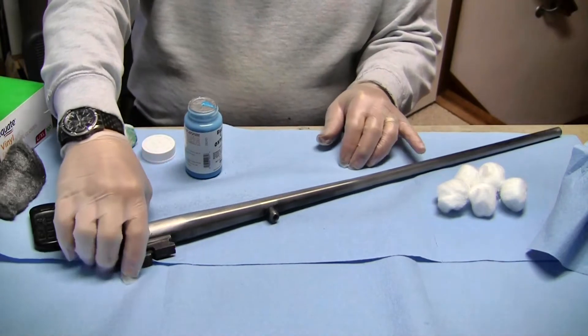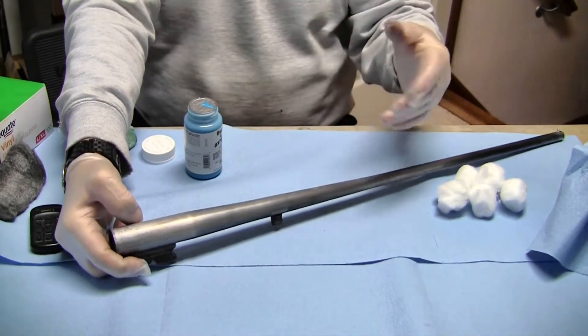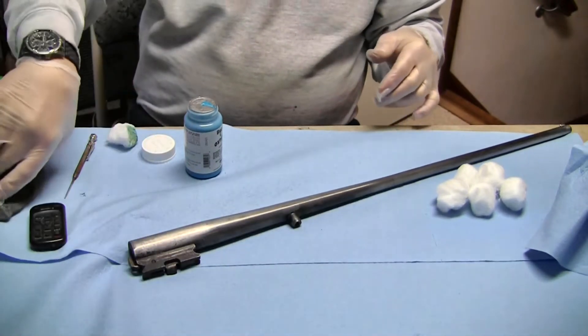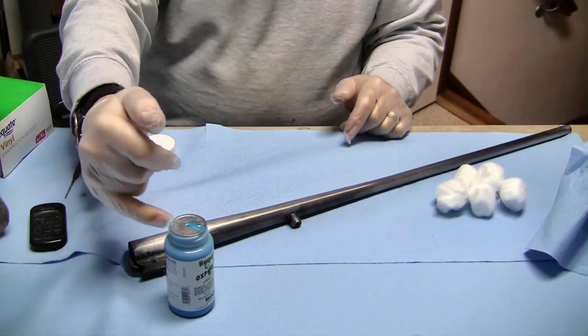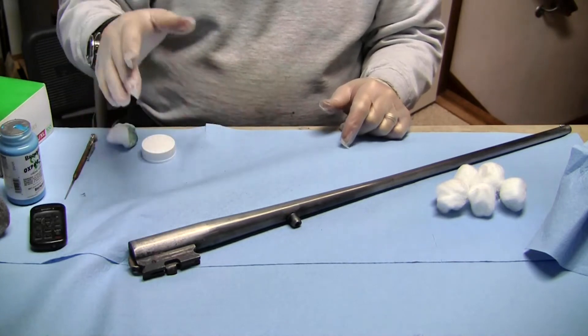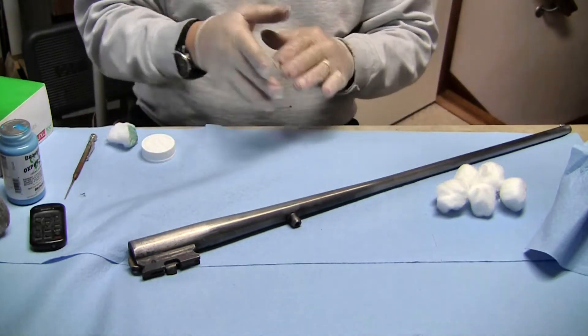The liquid is like water and it will pour all over. So we will get started here. Okay, we have our barrel. What I have done is run a degreaser on it. I am wearing gloves because once I degreased it I do not want to touch this again with my bare hands. I ran a degreaser and then I tried to brighten it all up with steel wool. The cream is a thick syrupy liquid unlike the other stuff which is like water. I wanted to use it on the barrel to take my time and get it done — it is easier to apply and will not run all over. So I am going to go with the larger piece using that.